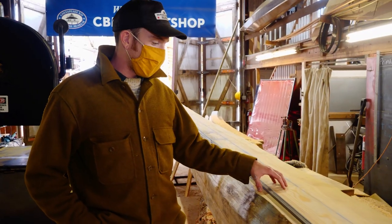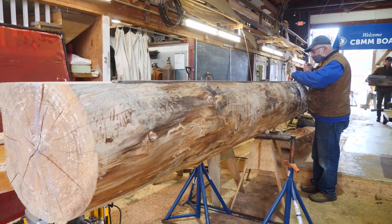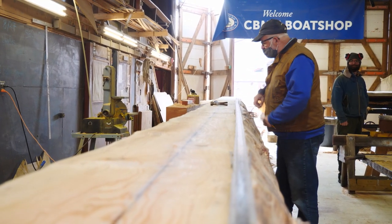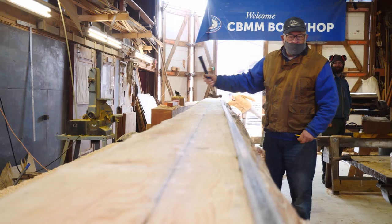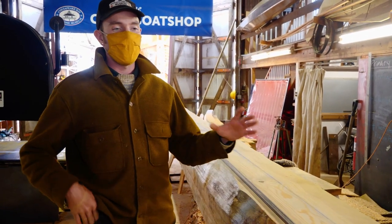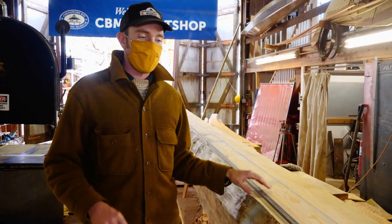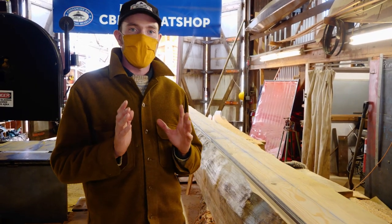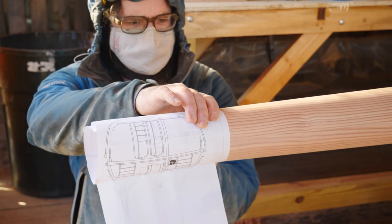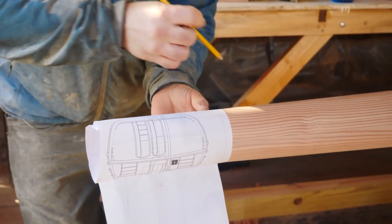This spar has a slight taper in it. Frank has laid out a fiberglass batten according to the architect's dimensions to lay out that slight taper. This is the lower mast. There is a piece that joins to it which is called a top mast. The top mast can be raised and lowered — it's separate but sits sort of forward of this mast to get additional length.